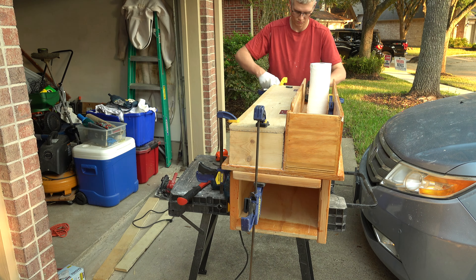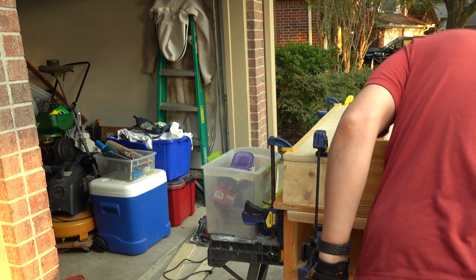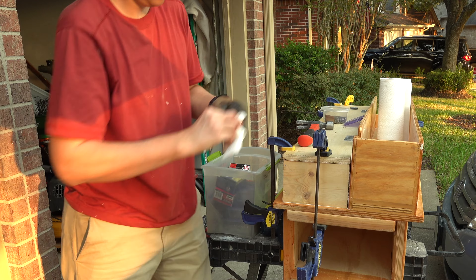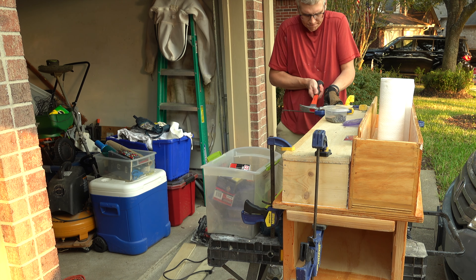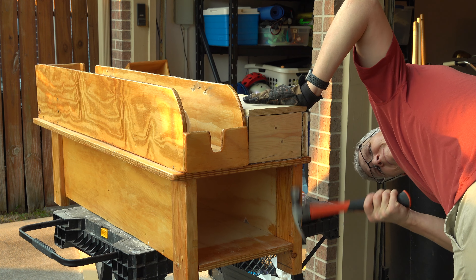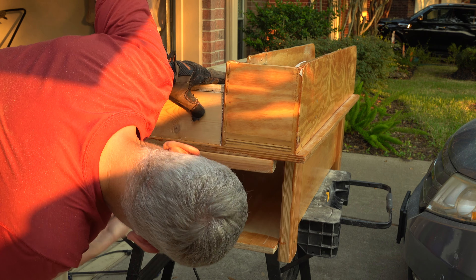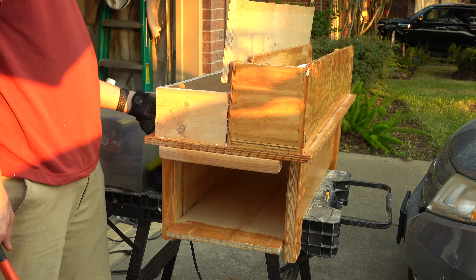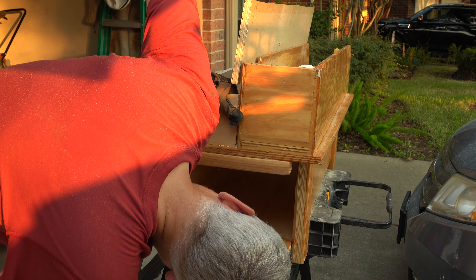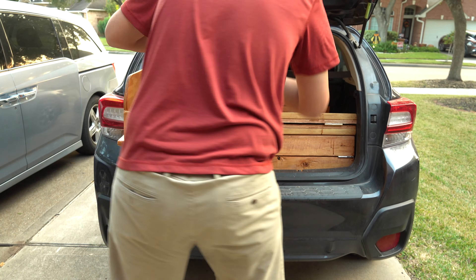Now I'm just going around making sure I got all the drips, and I think it came out fine. I'm driving nails from that short side into the long side, and I have a screw from underneath going into the short side. Once I do all that, this thing's going to be solid. The next day I do drive two nails into the side because that little short side — when it butts up against the other box — has nothing connecting it there. If I ever picked it up I could theoretically break it, so I end up adding two more nails.